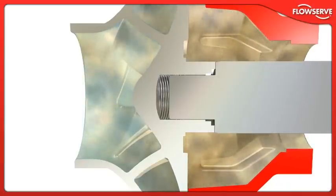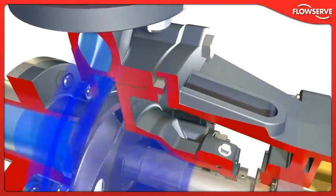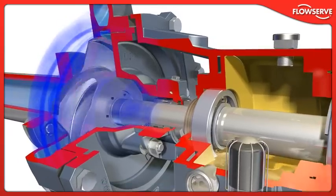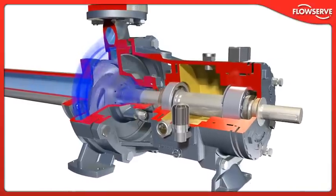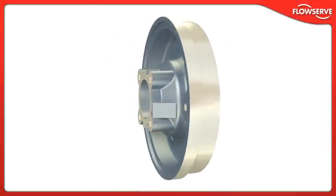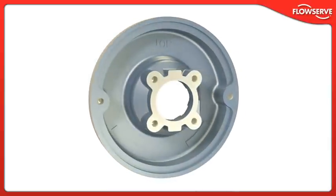The tapered design is also self-draining for safe disassembly during maintenance. The flushing action of the SealSentry seal chamber is so effective that expensive flush plans such as Plan 11, 32, 52 and 53 can often be eliminated. This not only reduces initial pump cost but can also eliminate costly plant water usage. FlowServe recognizes that not every application or mechanical seal can be accommodated by a single seal chamber design. That's why multiple SealSentry designs with tapered and cylindrical bores are available.